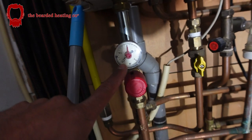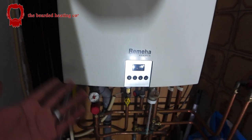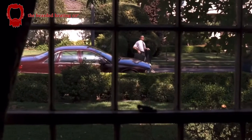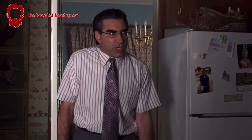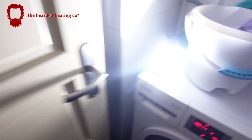On the next job for this day, it is a Remeha Avanta. I'm here to service it. As you can see, pressure's really low and the tenant has told me he's had to reset it with an E7 error. Not surprised — the pressure is low. So there's the expansion vessel. I'm going to start by recharging that, then carry out a strip service. You know how to service a Remeha Avanta — simple as eating pie. Just want to give a shout out to UniLight for lighting up my day.